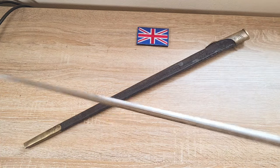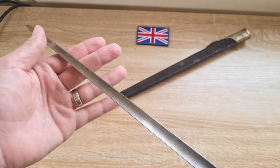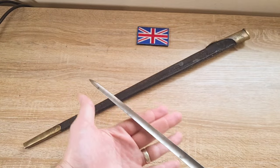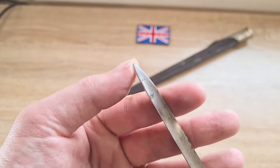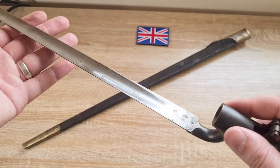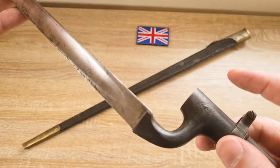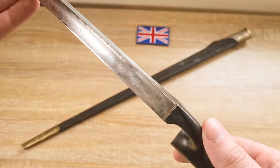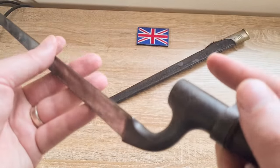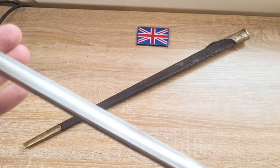Jumping into the construction: we've got a triform socket with a fuller running down each of the three surfaces. It is a very, very long bayonet, terminating in quite a good, sharp point. Moving down — I think this part is the shoulder — my nomenclature for sockets isn't great, but the shoulder is rounded. I can't tell if it's been brazed onto the blade. The socket has been heavily blued while the blade itself is still in the white.